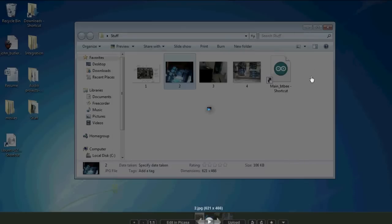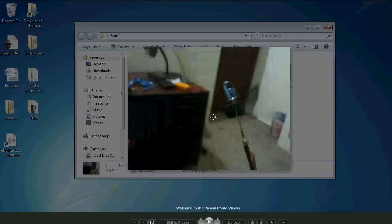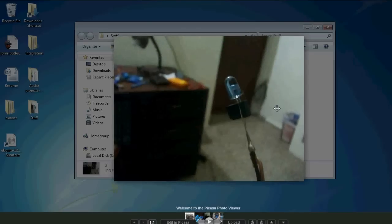In order to gain complete control of the TV, air conditioning, sound system, set-top box, I needed to observe and reproduce IR signals from their respective remote controls so that I could control them remotely through this microcontroller board. That's why I needed the use of this IR LED.